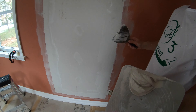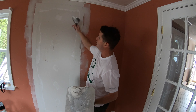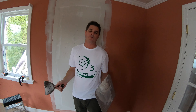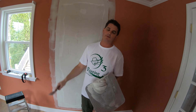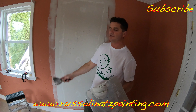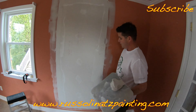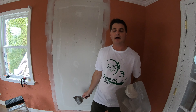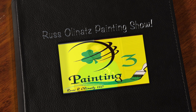What we just did was effectively pre-fill and add mud where the concaveness was, to help level off the surface so that when we go to tape, we're taping on a level surface. When you go to embed the tape, it will embed a lot easier than if you just try to tape it all in one shot. We're going to let this set and then we'll be back to apply the tape.